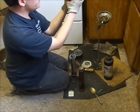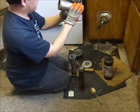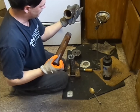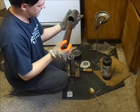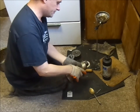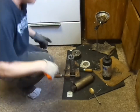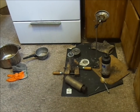While this process takes almost two hours total time — 90 minutes for the wax to set in the mold and another 10 minutes before the mold releases from the outer casing or tube — it can then be removed from the tube by a longitudinal movement. We have placed a mandrel in the center so that the blank will contract onto the wooden core, which reduces the necessity of reaming.